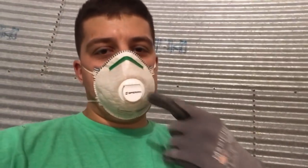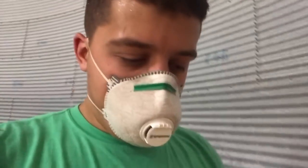You've got to keep the sweep suited up — sometimes it starts banging when it gets on the floor. You gotta wear a mask; it's just too dusty in here, you can't be having that stuff in your lungs. Don't try to be a tough guy if you're in these bins. I know a lot of old farmers that have got lung diseases from all this dust, so wear a mask.